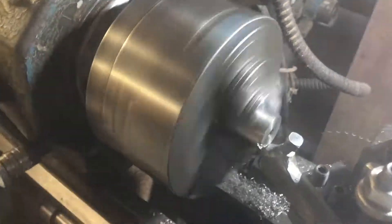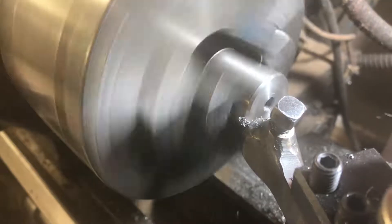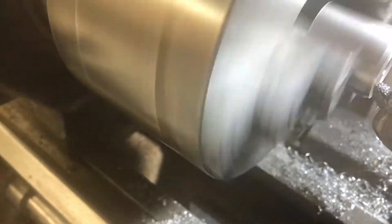I'm going to turn that noisy racket off. I'm being a bit lazy here — I'm just going to add a little chamfer. You can adjust the angle of the cross guide by adjusting a couple of Allen screws. You can loosen that and do a cross-feed taper — I'm just being lazy again, just adding a little chamfer to the end of the piece. It's not even 40 thousandths but it looks alright. Ok, that'll do. I'll see you next time.